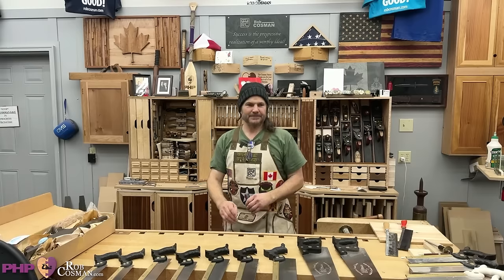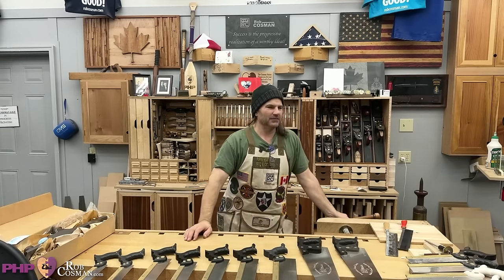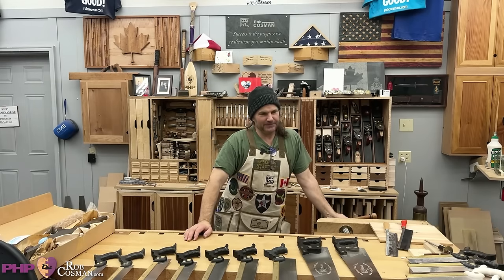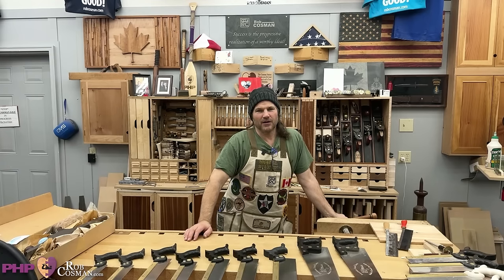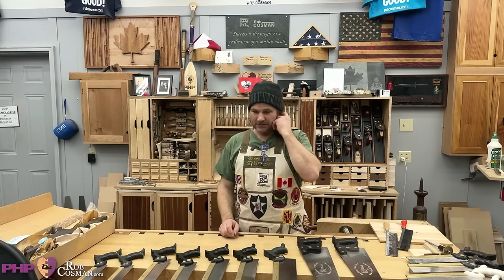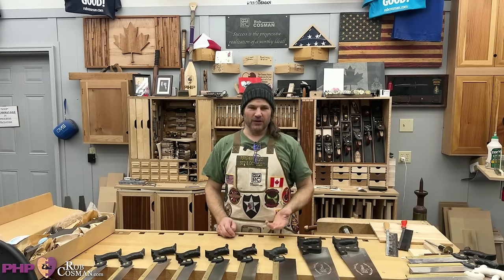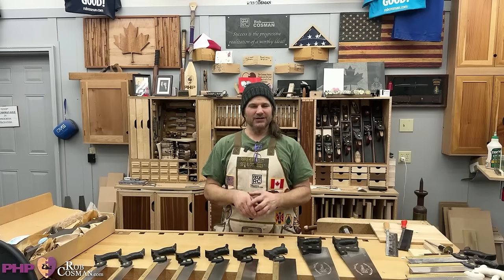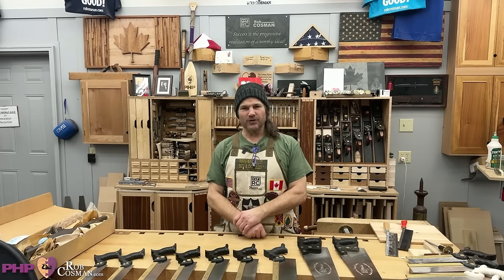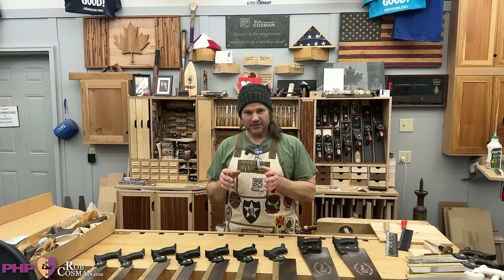Next one comes from BR Fenske in the chat. That's just his username. He says, how do you estimate how much lumber to buy when your project has many parts of different thicknesses? Well, it depends on how precise you want to be. If you're working with hardwoods, you need to get about 40% more than what you actually need. Need means taking every part and measuring it.